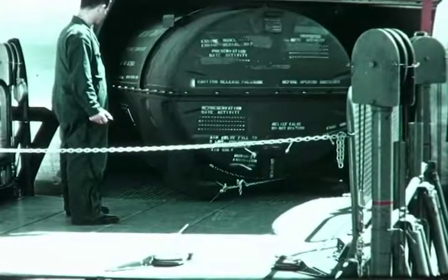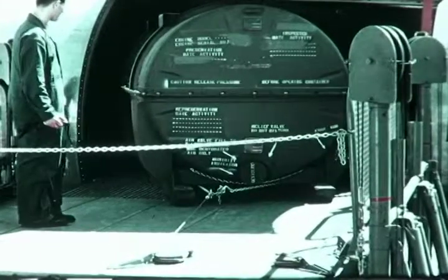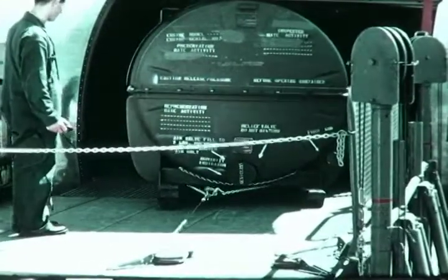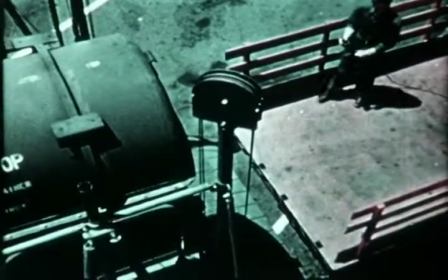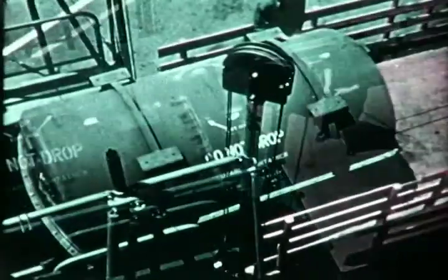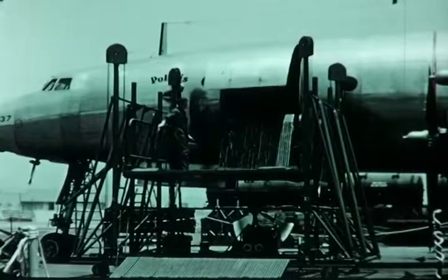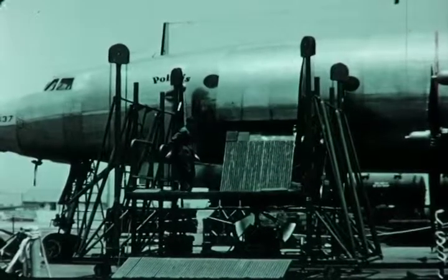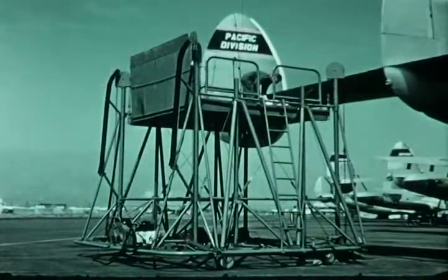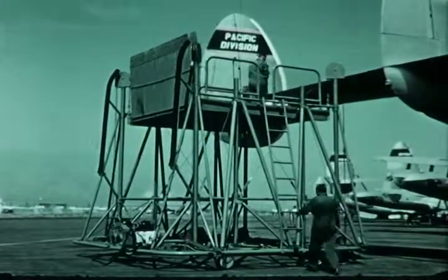To facilitate the transfer of large items, two pulley blocks are furnished with the Aerolift. These can be set into fittings which are provided in a convenient grid pattern over the platform floor. The platform can be stopped at any desired height so that cargo can be moved directly onto truck beds. For smaller size airplane doors, the width of the platform dock board can be reduced by removing any number of dock board sections. In addition to cargo handling, the Aerolift makes an excellent platform for maintenance work.